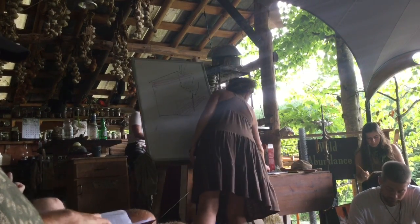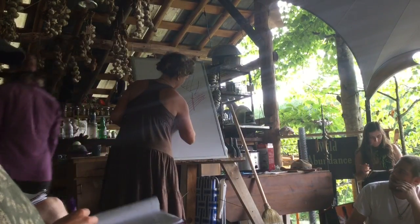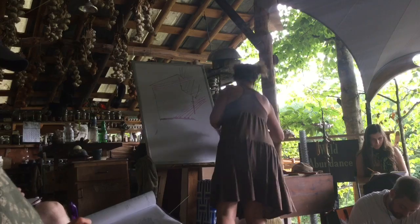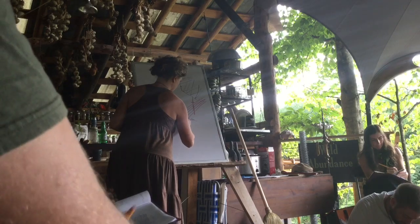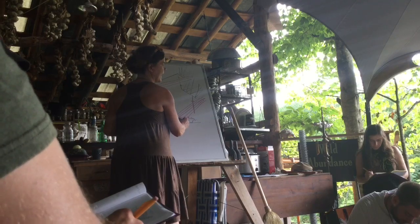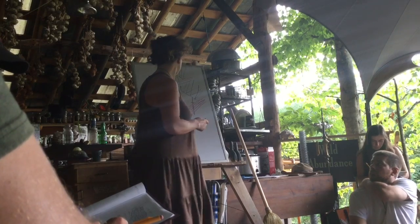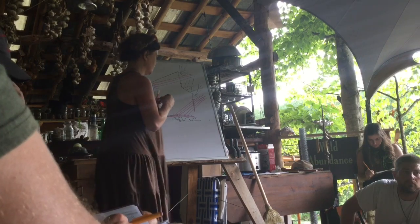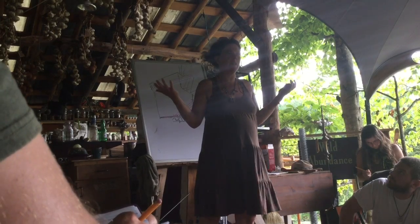And when you're doing your mass, so this is your mass, you want there to be some insulation under your mass so the heat doesn't escape underneath. Natalie, specifically floors for now, correct? Yeah, but also walls. I mean, I would want to have insulation. Yeah. But sorry, I was talking about the 3 inches, etc. Yeah. 2 inches, 1 inch, they're all great. Just not a foot.